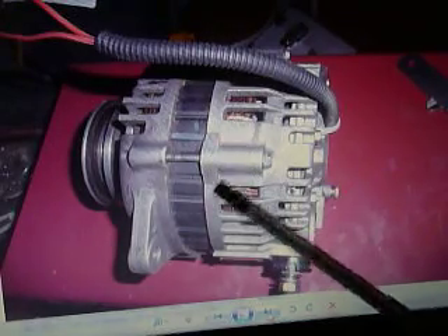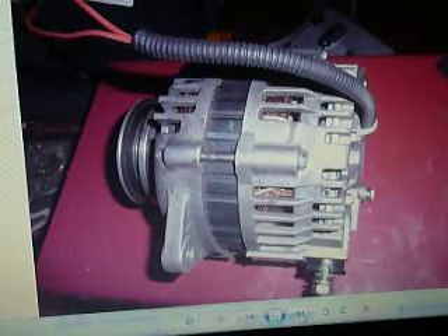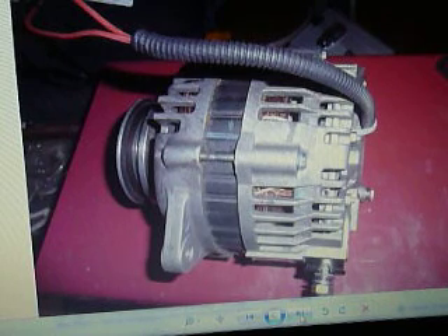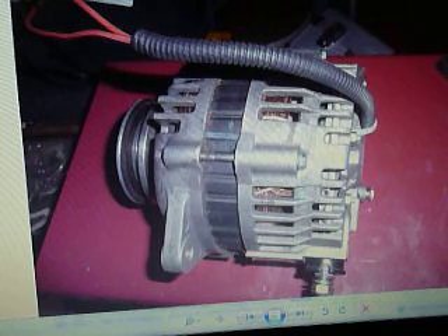What you've got now is an alternator with no control basically. I don't think you really want to run this alternator with it not connected to anything — ideally an alternator should always be connected to a battery. This alternator is specifically now designed to be permanently connected to the HHO cell, which is okay. Now you need to control that, so I was talking about a pulse width modulator to control your vehicle's 12-volt DC supply from the existing alternator — controlling directly the field to control your output.